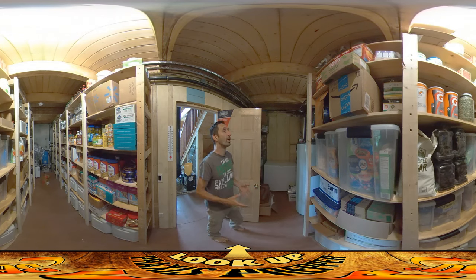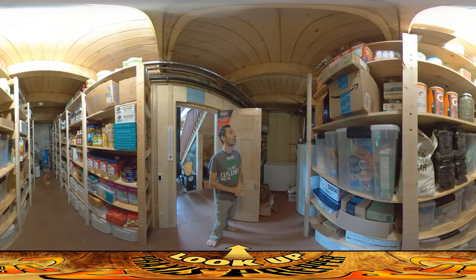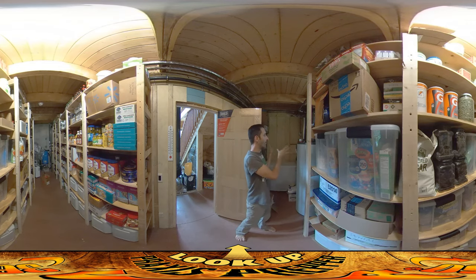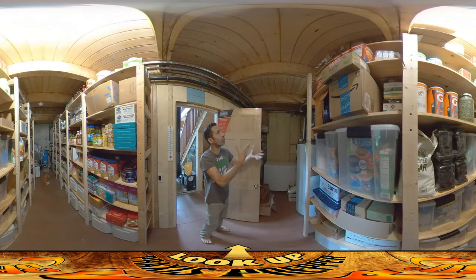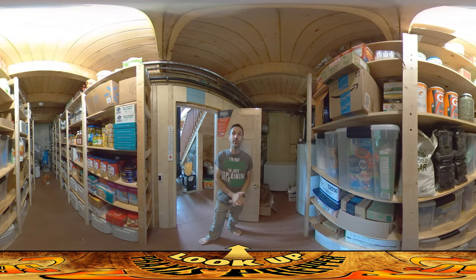My original plan for creating this room was that there would be a thermal barrier wall keeping utilities compartmentalized on one side and the pantry on the other. I kind of set that aside, but at this point it's got me thinking maybe I should build that wall, because there's a lot of warmth being generated here and I don't want it over in the pantry. I could find a way to creatively vent that heat up into another room. In the winter you'd want to benefit from it, but you certainly don't want it warming up your food. It's just another example of how, as you do things, you find little mistakes and things to improve — stay flexible and fix them as you go. Thanks for watching.